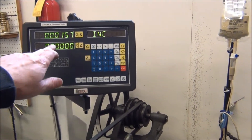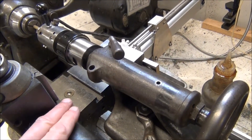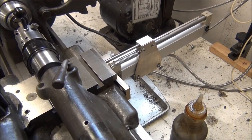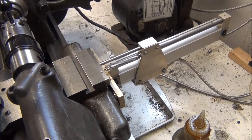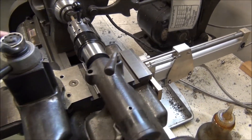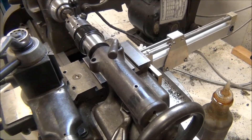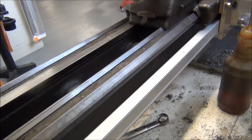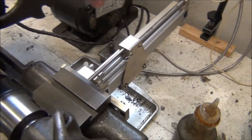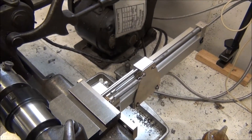One thing nice about this setup is I do have a digital readout on this lathe. So with my Z axis, if it doesn't cut as deep as I want, I'll just simply move the carriage over. If I want another 50 thousandths I'll just move the carriage to the left 50 thousandths. This is one of those Chinese DROs that I put on here — I really like it a lot, it was a real bargain, but I had to make quite a bit of hardware to mount it on the South Bend. Here's the Z axis scale and some of the hardware I had to make to get it to work. It's on a spring so that it tracks the carriage motion, and it's very accurate.